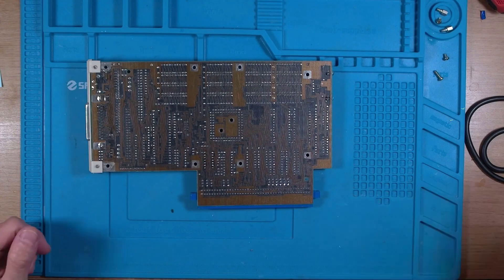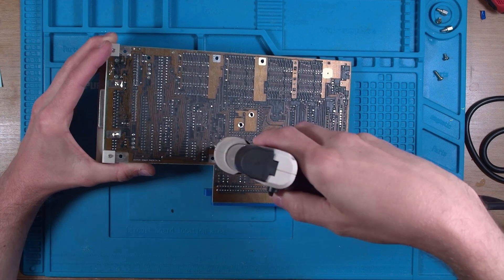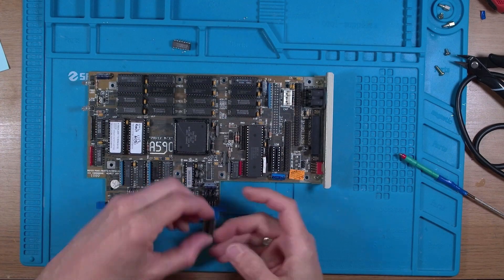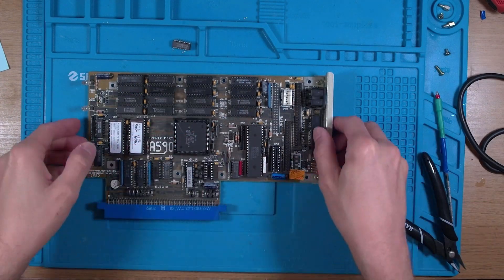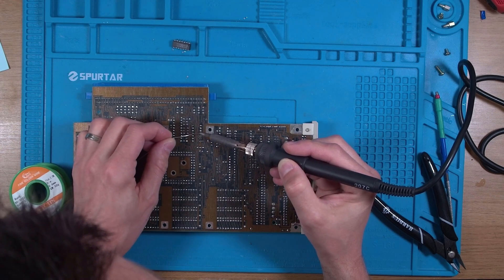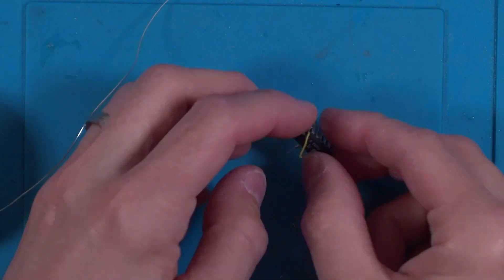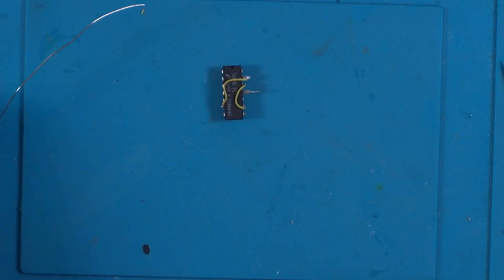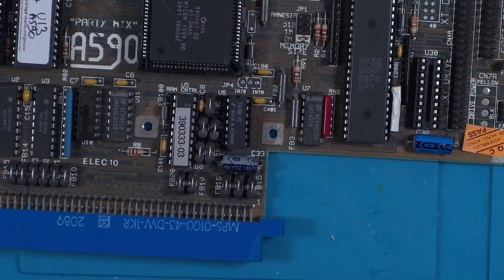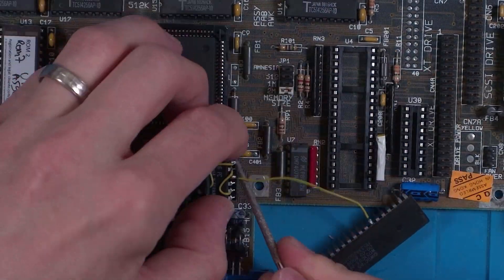Let's do the mod! To make this mod easy, and to allow it to easily be reversed, and because I don't actually want to cut tracks on the board, I'm starting off by removing the U6 chip from the board and replacing it with a chip socket. This will allow me to swap in and out the chip as required. Also, because one of the signals we're supposed to cut off is actually under the chip — that'd be pin 13 — this will also make that part of the mod easier. Now, the 74LS86 isn't really fast enough and the signals out of it are actually quite poor, so we can upgrade it with its faster cousin, the 74F86 — F standing for fast — and also add a decoupling capacitor too. I'm literally adding all of the mods directly to the chip. I've also removed the SCSI controller chip and bent pin 7 out of the way so I can attach the new signal to it, and all this completed without any permanent modifications to the PCB.